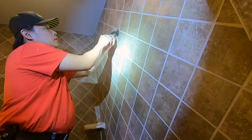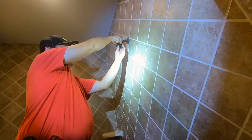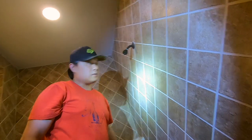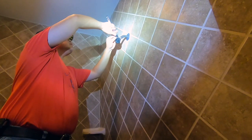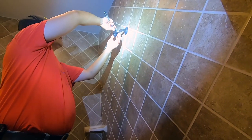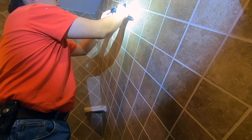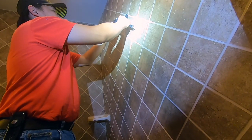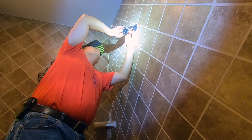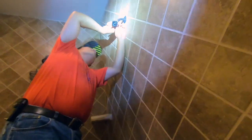Once it's pretty tight by hand, I'm going to take a pipe wrench and do about half a turn. I have an adjustable wrench and I'm adjusting it to the exact width of that flat notch. Once I have it, I'm just going to turn it about halfway - you don't want it too tight. Make sure it doesn't slip so you don't make a scratch on your brand new shower head.